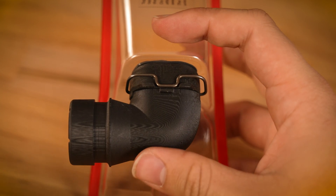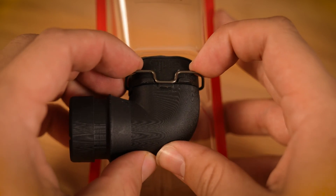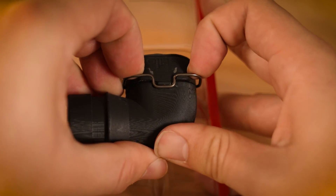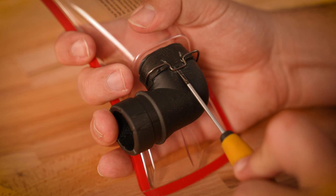To lock the adapter, you will then need to take your fingers and apply forward pressure to the spring towards the rear of the adapter. You'll then hear an audible click as the spring rolls over top of the locking feature. To remove or change your 90-degree or straight in adapter, you'll simply reverse these steps.